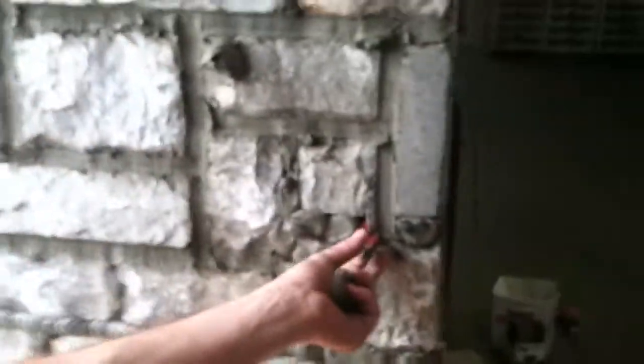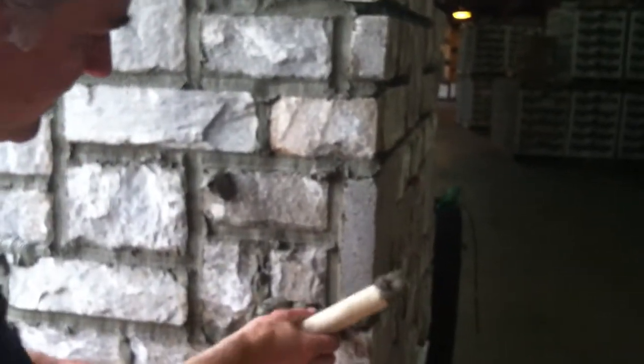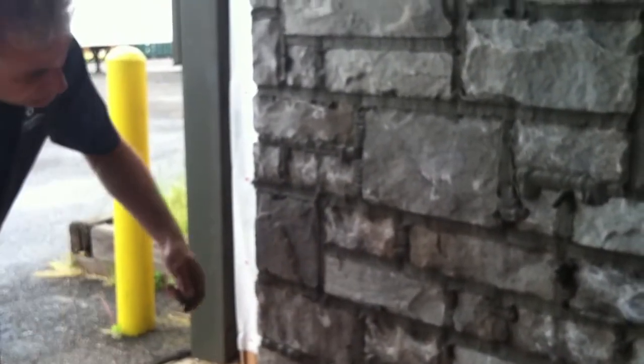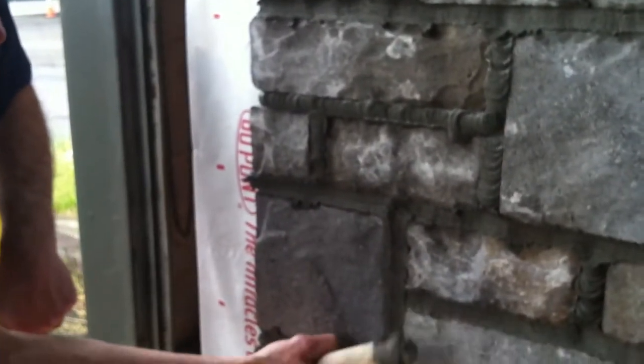Alright, on this button cap I'll just take it out right now. I'll grab some of my mortar from down here — there's a bit of a void there. This is a little bit wetter than I'd want it to be, but it will still work. This is where I didn't think the guy filled the joint all the way, and it pushed in a little bit and didn't come to the surface all the way in that area. So I'll just do a little quickie repair.